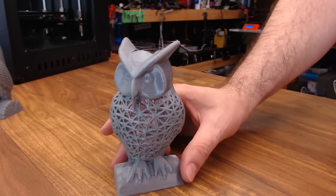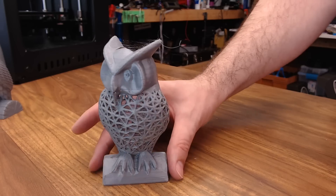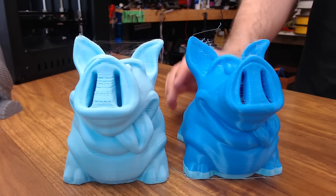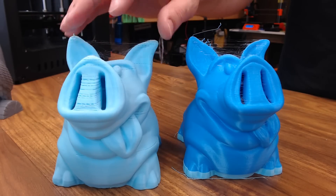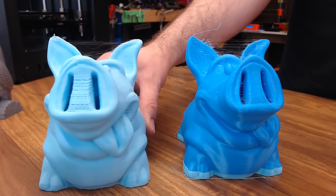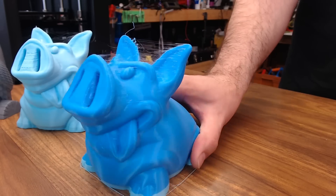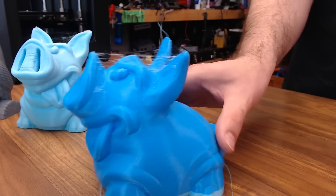Then I went with the same owl, only with a lattice body, and you can definitely see where the part cooling comes in. Same filament as the last one — it's just really stringy. In all fairness, this is a pretty hard test for a lot of 3D printers. Here are the piggy banks I tried — this one has a lot of missed layers. It just didn't like this particular brand of filament; I believe this was Inland that had probably been sitting around a little while. But then I switched to some Filament Friday filament that prints at a cooler temperature, and it came out so much better. The printer is somewhat unpredictable based on the brand and type of filament you're using.